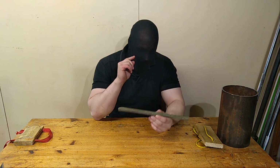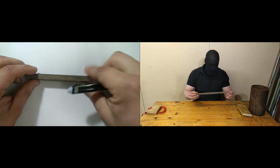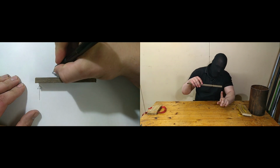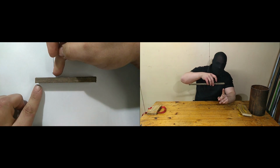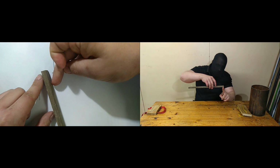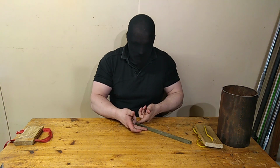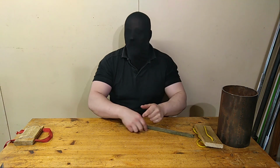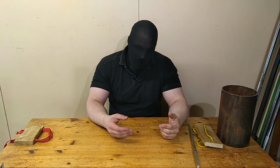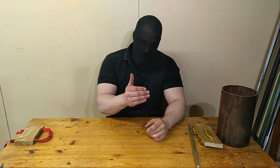Alright, so the principle here is that when you have a stick like this, and you are applying a force to the stick, here comes the force, and two opposite forces which are not aligned, like one force and the second force. They cause a torque to this handle, which turns it around, creates a spin to it, like so. This kind of situation always happens when you have a fingertip handle, when the force pulls from above the point where your fingers are applying the force.